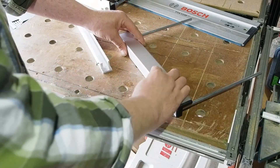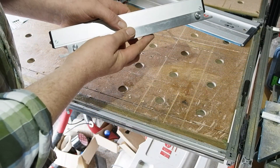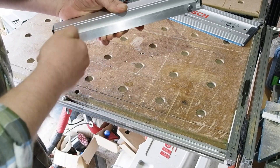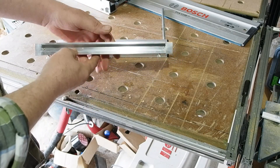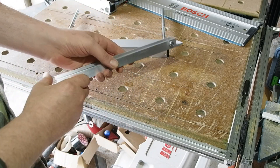On this TS spacer you'll notice the base is a little thinner to match Festool rails, and the overall width is less than the Mafell version — same aluminium stock and fixings. I hope to send this to a Festool user soon to get their feedback and maybe a video too. On both brands of fence the spacer can be left fitted when using the fences the other way around as a parallel guide — the spacer won't get in the way.